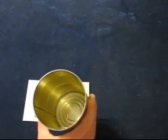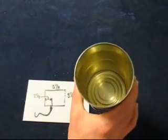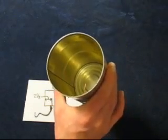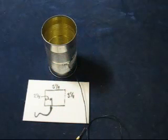So that's important because it has to match the wavelength of your signal. And that'll be close enough. Okay. Some tips on using the antenna. It really should be near a window. If you're trying to get a signal from outside, put it near a window. Make sure the screen is not in the way of the signal, because some of the metal mesh screens will